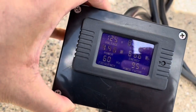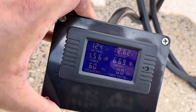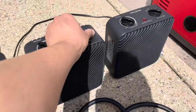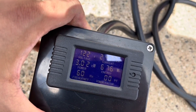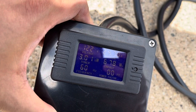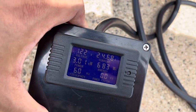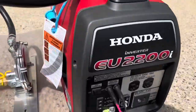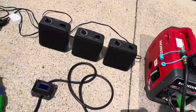The first heater should read 1,500 watts — and that's about right. We're going to turn on the second one now and see how much that reads. With two heaters on, we're reading at 122 volts, three kilowatts, 60 hertz — looks pretty stable — and 24 amps. Looking good so far. I don't see any overload light on either generator. Generator sounds pretty much healthy.